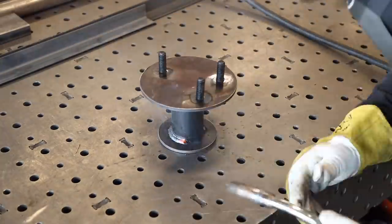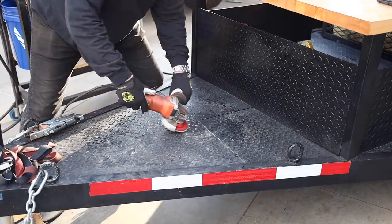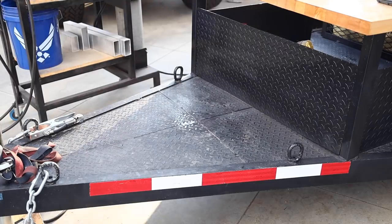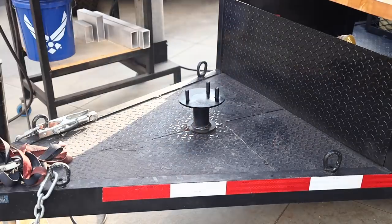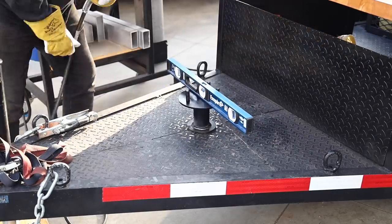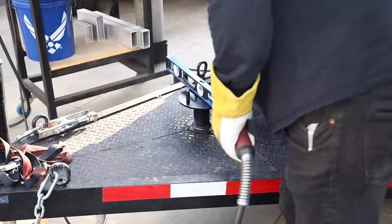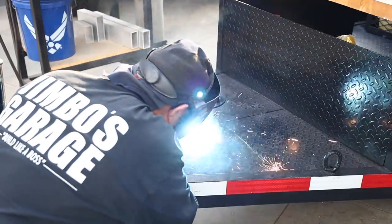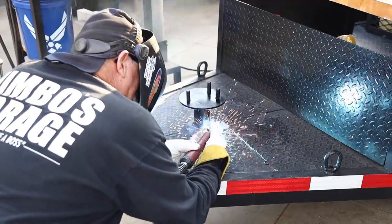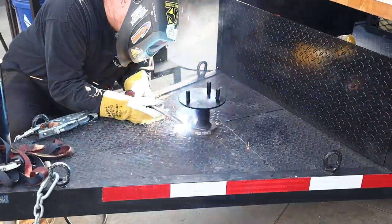The mount is pretty much complete. I took a grinder to the area where it's going to be located, took off some paint to get bare metal for a good positive ground. Once I got it located, I tacked it in place, put a level on it to get it as level as possible. I started welding it out and the diamond plate is real thin, so I burned a hole right through it — just bumped that to fill it in. Once filled, continued welding all the way around; it's not going anywhere.